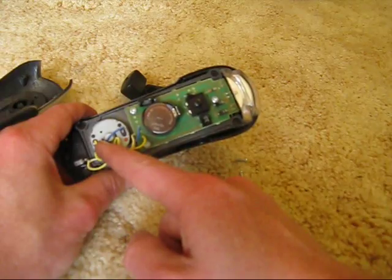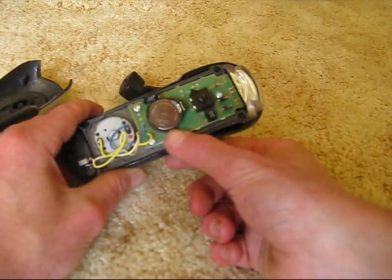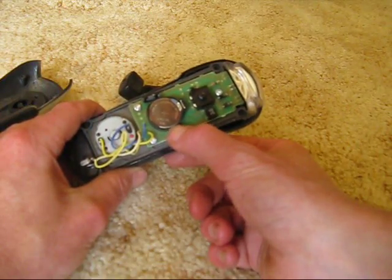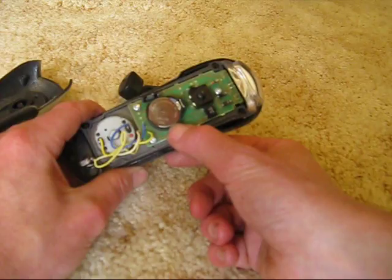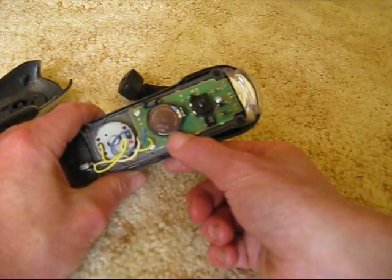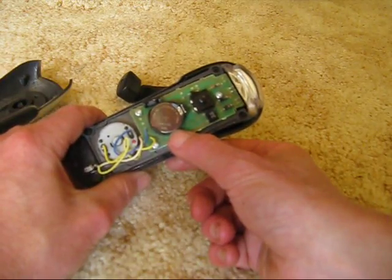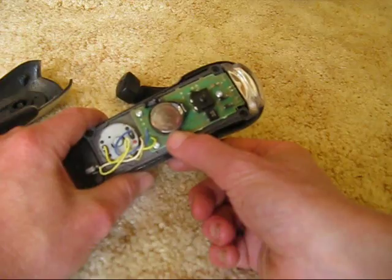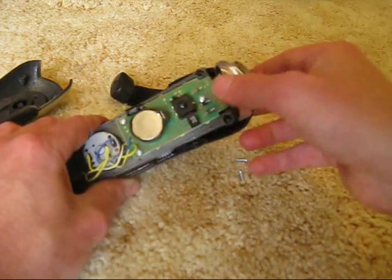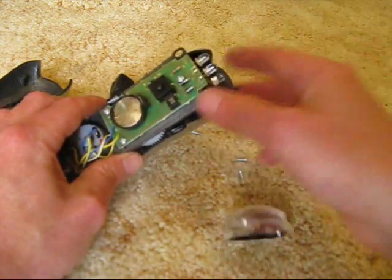The generator is down on the left. In the middle is a battery. It looks suspiciously like a CR2032, the sort of battery you might get in things like car remote controls. Although, looking at the print on the battery, it does say lithium-ion rechargeable battery — LIR2032, 3.6 volts. Then there's the switch and the LEDs: three LEDs plus a reflector.